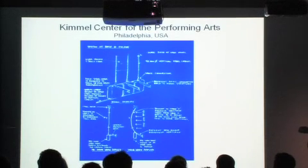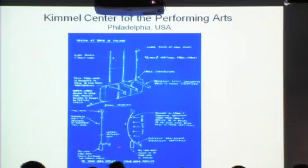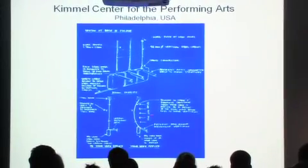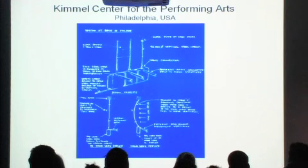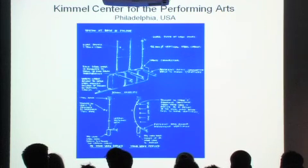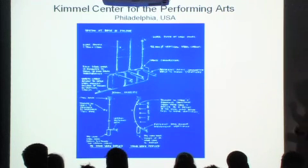That's the principle. It shows the cable being deflected by the wind and the weight rising up, and then it would come back down again. And the other thing that is interesting as an idea, I guess, is deflection, because someone says, how much should you let a piece of glass deflect? You say, I don't know. What does it say in the book, or something? Anyway, you probably say span over 200, so if it's like a 5-meter span or something, you divide 5 by 200 and get 25 millimeters, right? So you should really only make it go 25 millimeters, right?